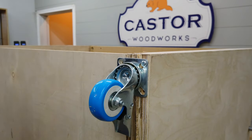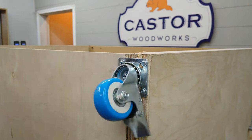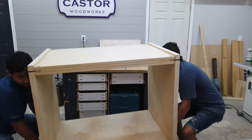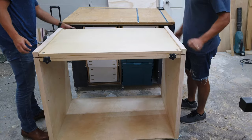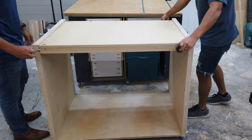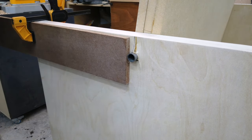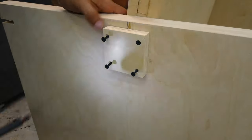I use these three-inch casters on pretty much all my projects, so I'm going to include a link in the description. I got my brother to come over and help drop it on the ground — this thing probably weighed about 400 pounds, so make sure you have help when bringing it down. Now we're testing it and it spins perfectly. I used a half-inch spacer and my Dremel to cut through the tube and topped off the ends with a small piece of plywood with a three-quarter inch hole, then screwed it to the sides.